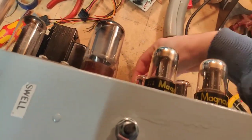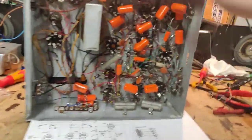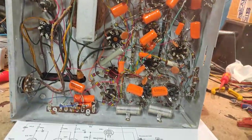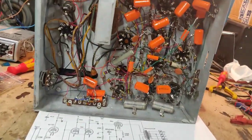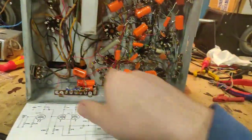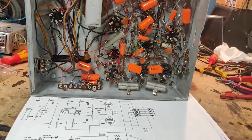That will be kind of cool — we'll have a use for the 6SQ7s and the rest of these vacuum tubes. So we're going to be doing a complete rebuild of this thing basically. I'm going to completely gut everything except the output and power supply. I'm probably going to have to rewire the power supply a bit, but we have plenty of filter caps and all of them are in excellent condition.